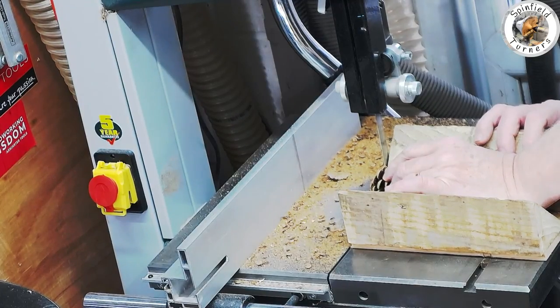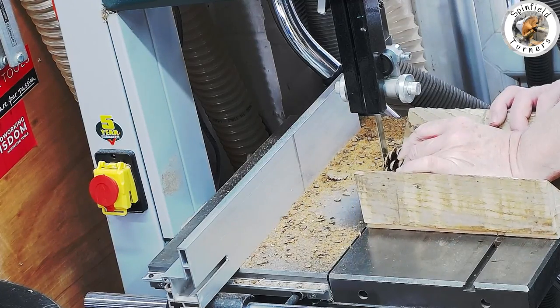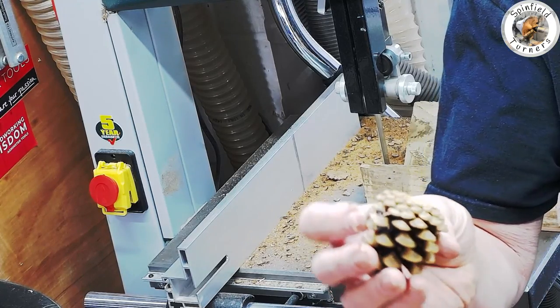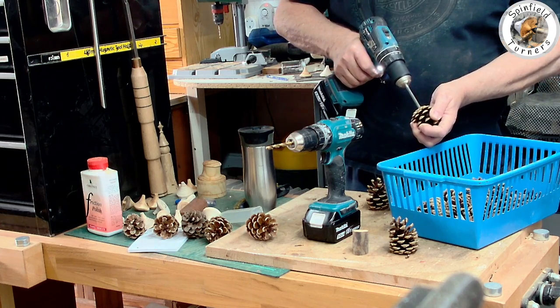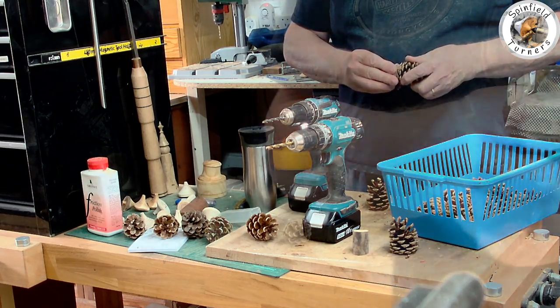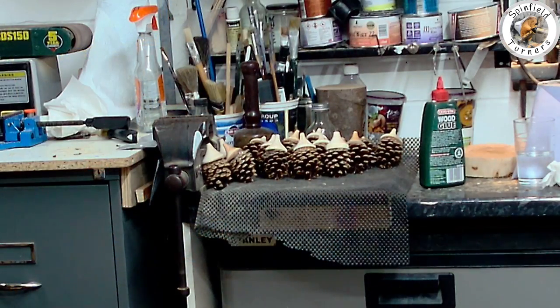The pine cones need the face flattening in order to be able to tape the nose, so that's best done on a bandsaw with a frame so that it doesn't catch in your hand and you cut it so that it goes flat. I've turned the faces and noses with a little dowel on the end, so I'm now drilling a six millimetre hole in the base of the cone so it can then be glued in place. It can be quite tricky to get that hole drilled because the pine cones are quite hard. And there they are, gluing up with the tops stuck on and ready for pyrographising after the glue's dried.